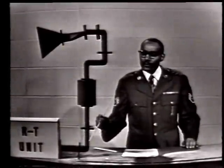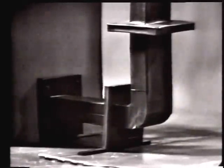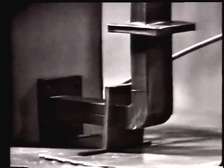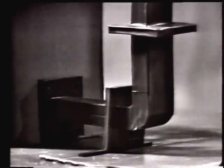Now, this bend which we have inserted into the system must be connected both physically and electrically to the rest of the system. And we said we use a choke joint to make the connections. This choke joint gets its name from a component you're already familiar with, the RF choke. You'll recall that the RF choke is used in electronic circuits to choke off the RF energy and keep it in the part of the circuit where it belongs. The choke joint accomplishes the same thing for the waveguide. It prevents the energy from escaping from the waveguide where the physical connections are made.